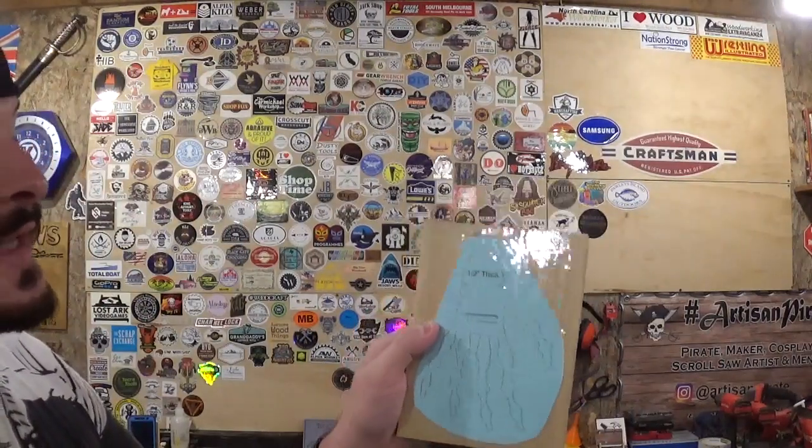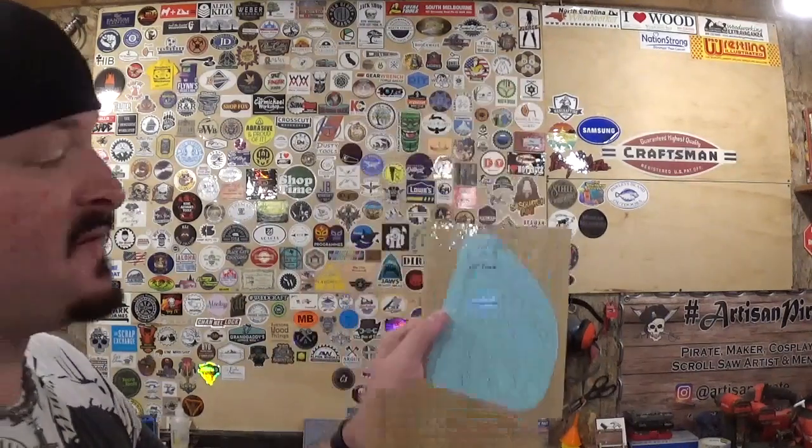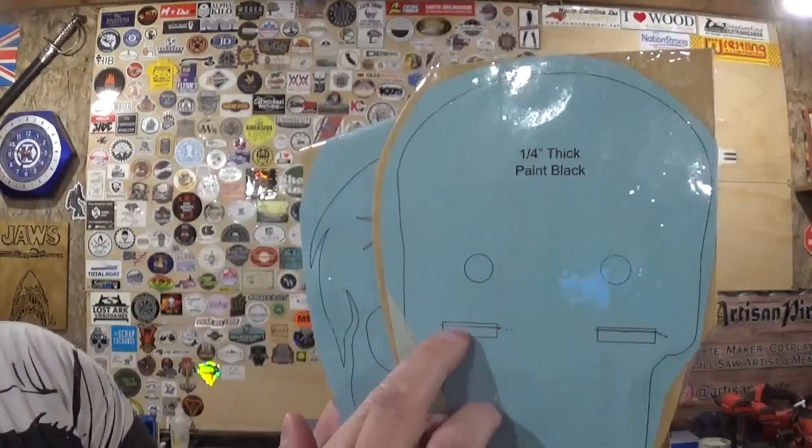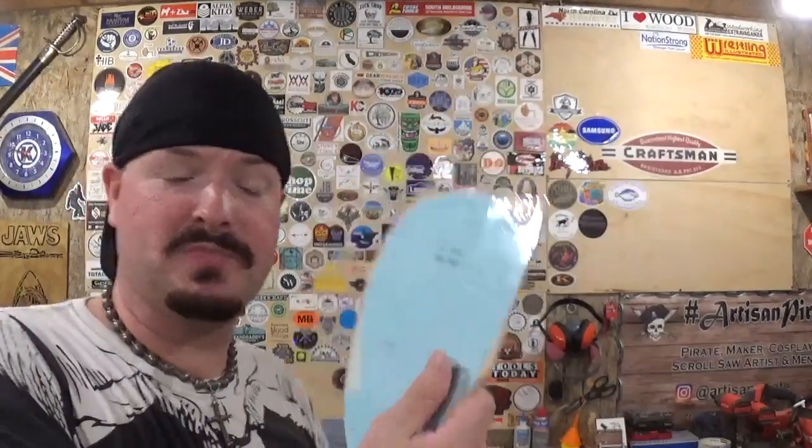The base is going to be the skeleton's hand, which is the half-inch piece with tab designs. Keep in mind that not all quarter-inch material is exactly one quarter inch thick, so take careful measurements and make sure your tabs will not be tight when you insert them into the slots. What I've done is redrawn the cut lines on Steve's patterns to match the actual thickness of my material. Patterns are printed and attached, so I'm ready to head over to the drill press and drill all the pilot holes.